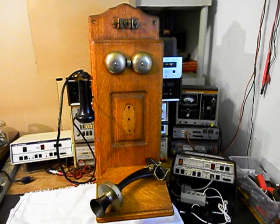Now I know that the video probably cannot pick it up, but the lightning arrestor at the top of the cathedral of the telephone, it does look like there's an indication that this telephone was hit by lightning at some point. The teeth in the lightning arrestor on the inside on both sides have little metal drips where the teeth are, so it does look like it was hit by lightning at some point.